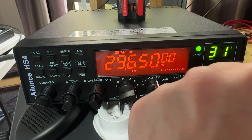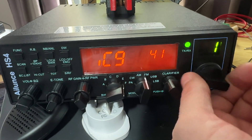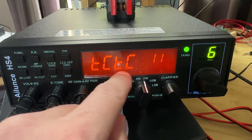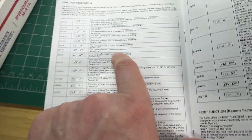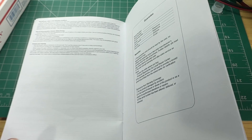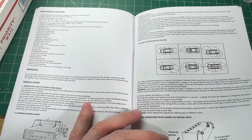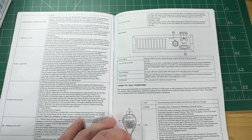In FM, if I go up to the repeater portion — our repeater is on 29.680 MHz — in the menus there is an option to set a CTCSS tone. There's a transmit CTCSS setting, and I've got it set on number 11 at the moment. However, the manual doesn't actually show anywhere what numbers correspond to what tones. Our repeater uses a 91.5 Hz sub-audible CTCSS tone, so I had to figure that out by trial and error. That's a missing piece from the manual.